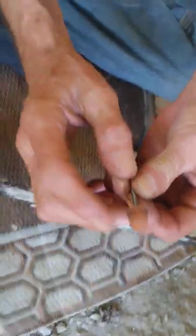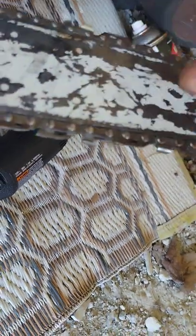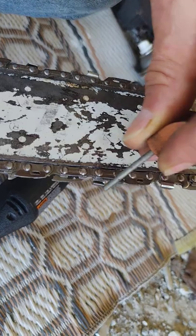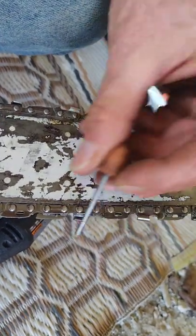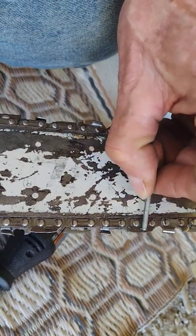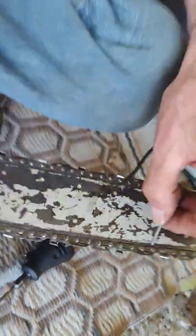With this stone, you always do this part first — taking what I call the dregs. That's what the wood rides on before it hits the tooth. The wood comes scooting across here and it catches a little piece of a sharp edge that sticks up above this. See, the tooth is on an angle like that. The further back you sharpen it, the more you got to bring these down. That's what makes the size of your chip — how low this is down. But if you get it too low it'll catch in the wood.